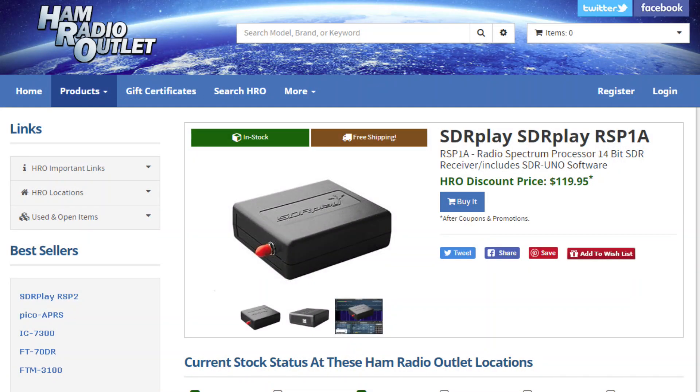Since the last 1788 testing, I've acquired the SDR Play RSP-1A, which does a marvelous job of displaying the entire spectrum for each band in turn. I set the rig, the antenna, and the RSP-1A to 20 meters so I could do some experiments. The RSP-1A is connected to the RF output of my Yaesu FTDX 3000, so it sees what the radio sees.